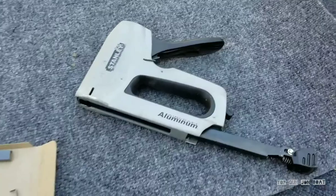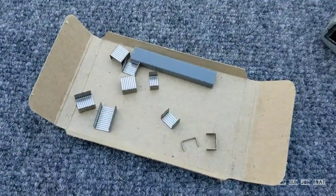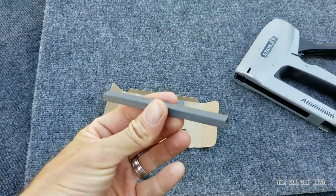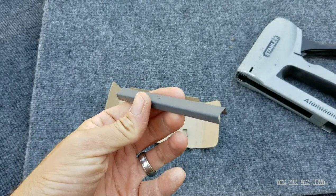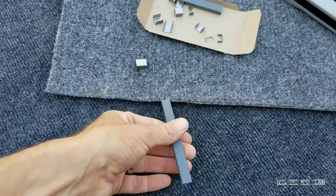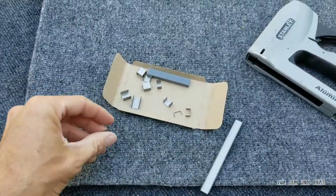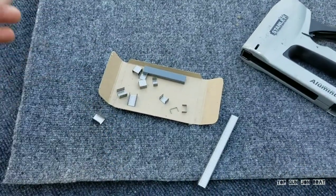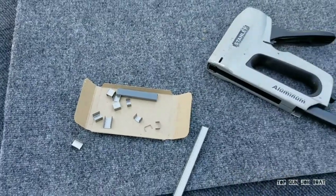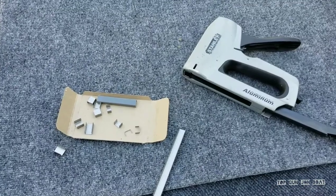All I'm going to need is my trusty staple gun and I've got some quarter-inch staples — they're actually stainless steel. The stainless won't rust, obviously. But what I do is I take this Rust-Oleum flat gray paint and hit them with a quick coat or two. That way when I staple them through this gray carpet, you probably won't see the staple — the stainless will reflect a lot of light and stick out like a sore thumb when light hits it. So just to give it a cleaner, more professional job, that's how I hide my staples whenever I do any kind of carpet work. Just a little tip.